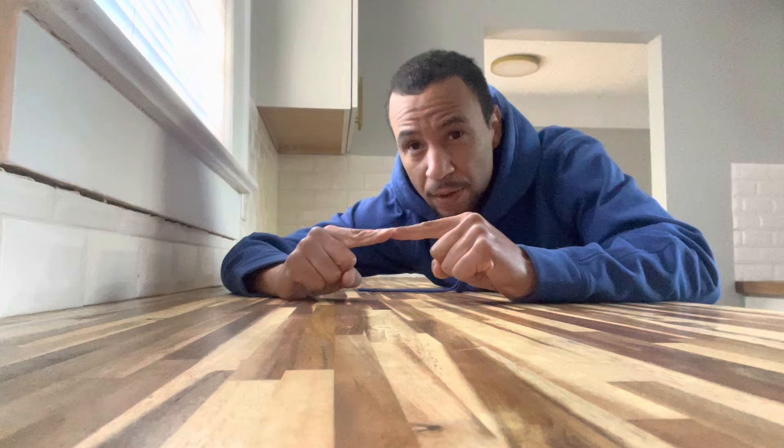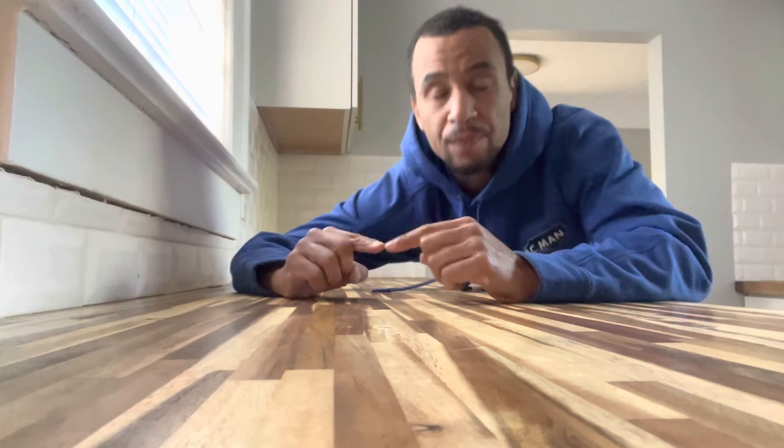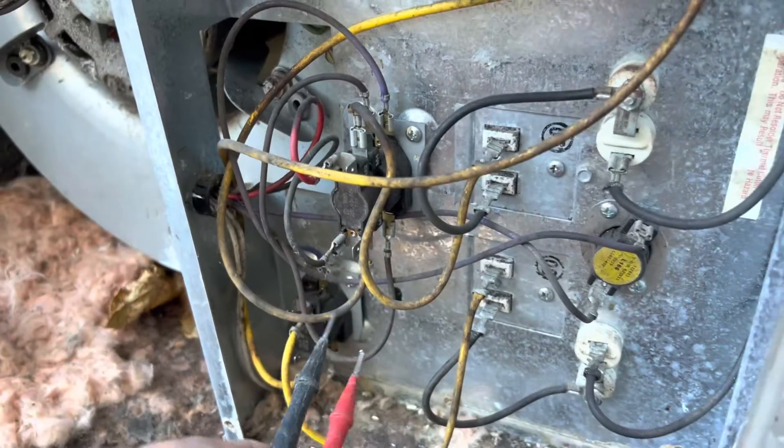This is what I mean — if there's 120 volts on this wire and there's a motor here, that 120 volts will go through this wire to this motor. Your meter subtracts, which means if this switch is open, there's voltage on this side and no voltage on this side: 120 minus zero equals 120. If the switch is closed and you put your meter on both sides, there will be 120 on each side — 120 minus 120 is zero. So to recap: if you measure across a switch and it reads zero, that switch is closed; if it reads voltage, that switch is open.